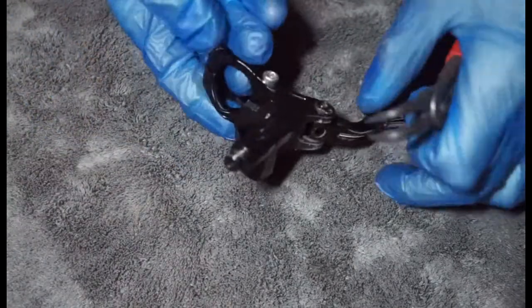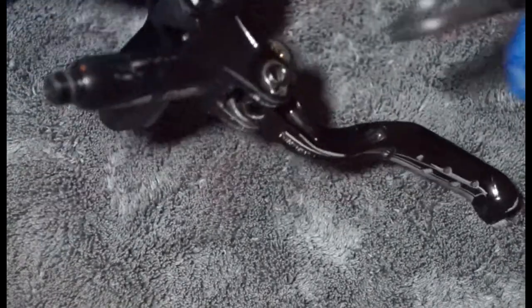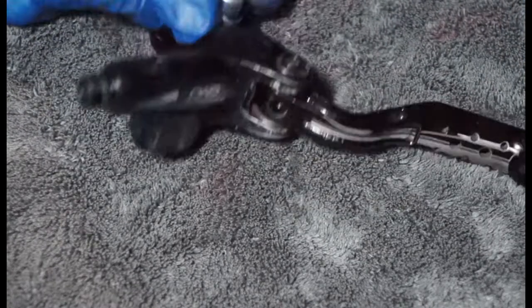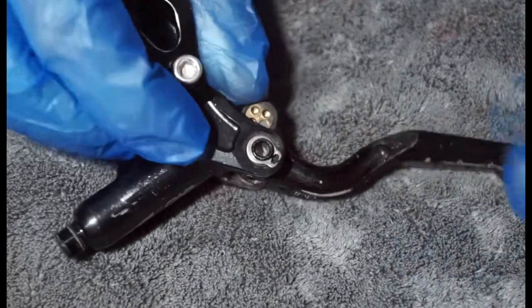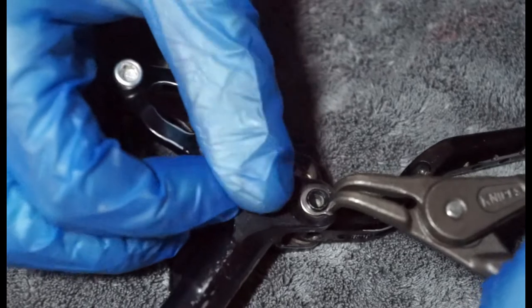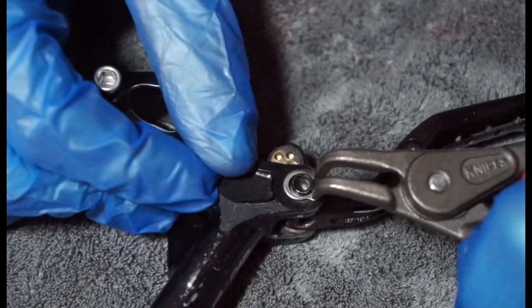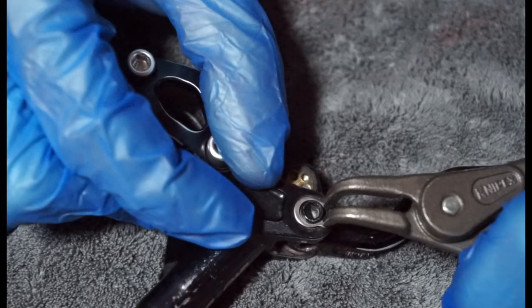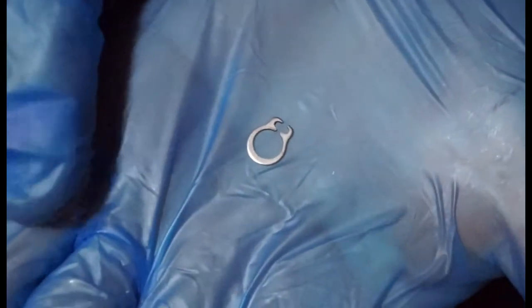If I get my circlip pliers underneath there. This one's unusual — it looks a bit weird with that bit sticking out. It's kind of strange but we're going to open this little circlip. What you want to do is just open it enough to get it over. You don't want to overstretch it because it will essentially go out of shape. There's your little clip there.